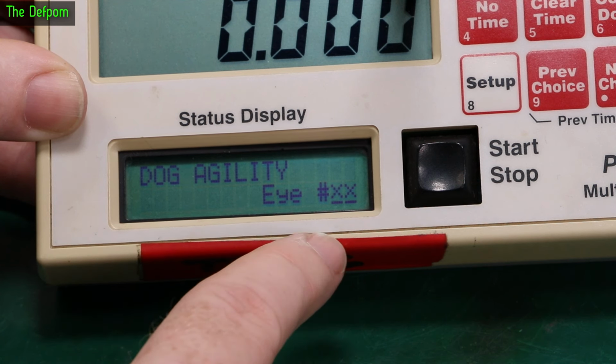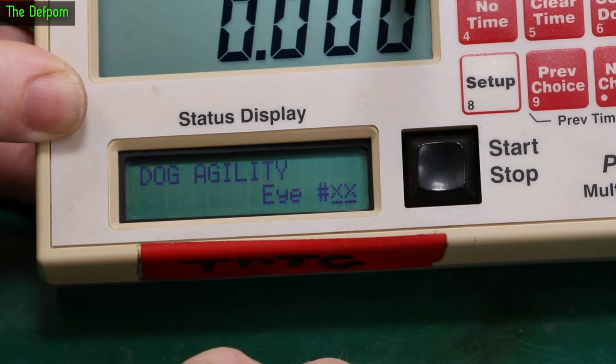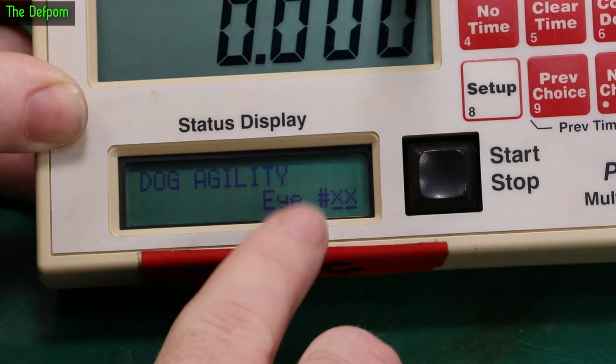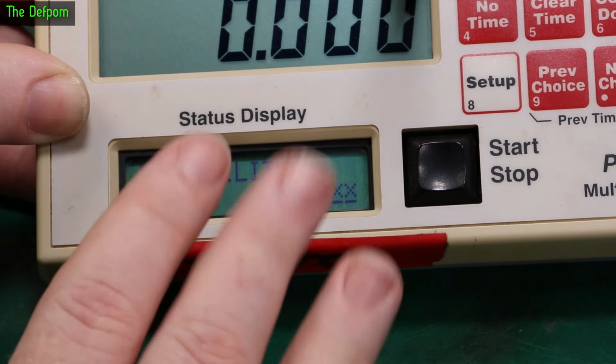Now, that makes me think that there could be an issue with the display itself. Maybe the control. Maybe there's a voltage regulation problem where it's not actually regulating the voltage. You can see now the square is almost barely visible, but the contrast is fading back. That's the first issue I found, that this display isn't quite behaving right.